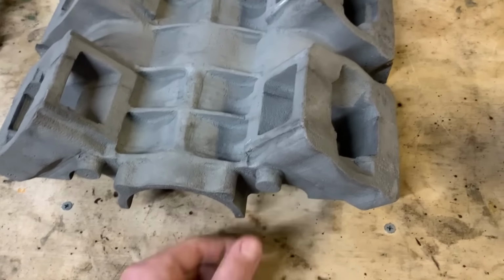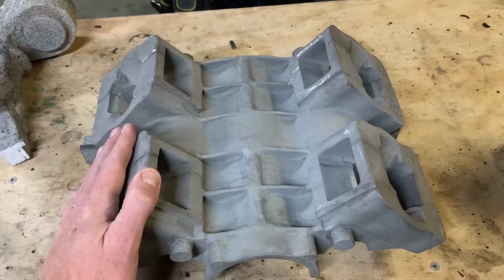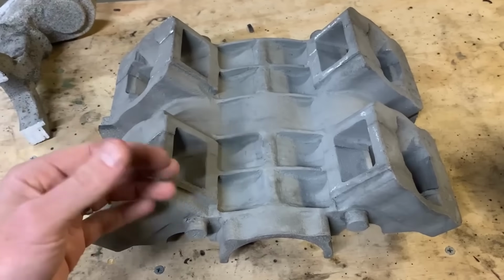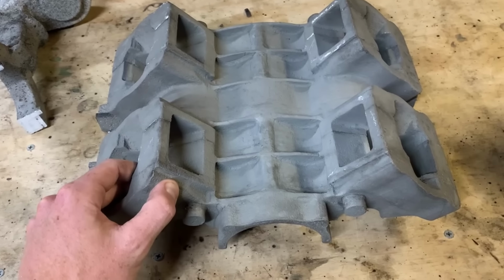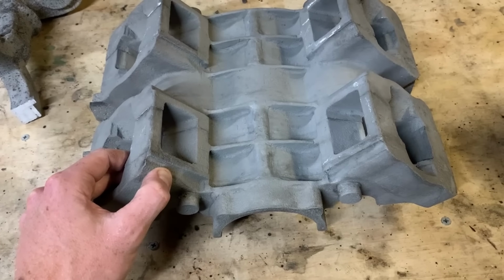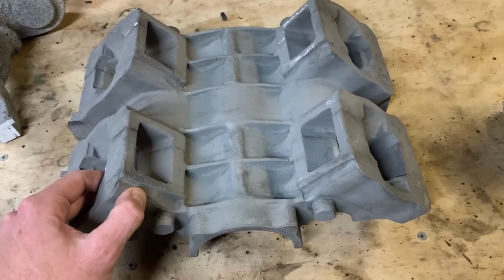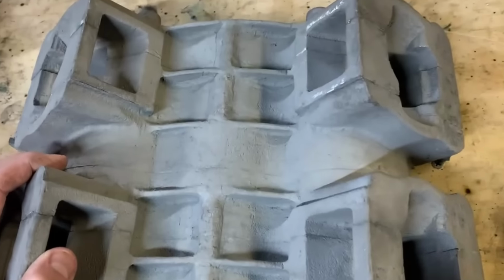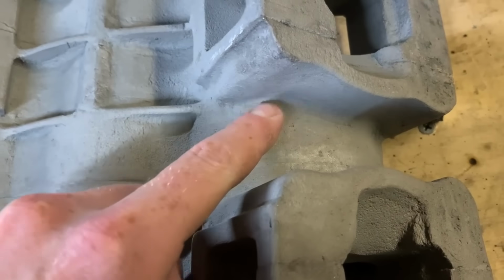These were after the fact too, because what happened was this took a solid week to manufacture. I did this in 6 individual pieces of foam, all flipped once, so that's 12 setups with tool changes on every side, and that's manual tool changes. It just wasn't fun. It took a whole week and I didn't want to muck it up, but we got enough material to clean this up and use it, so that's cool. The center section came out all good, as machined, pretty good.